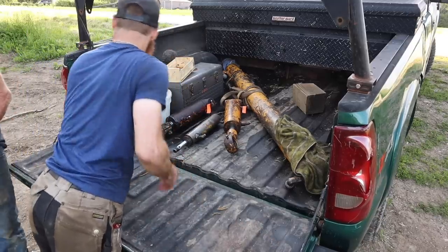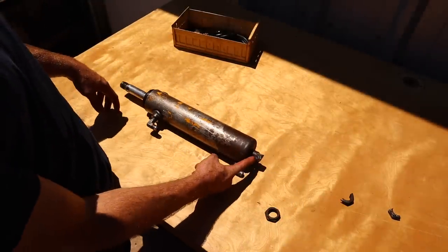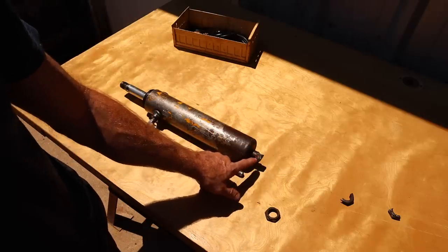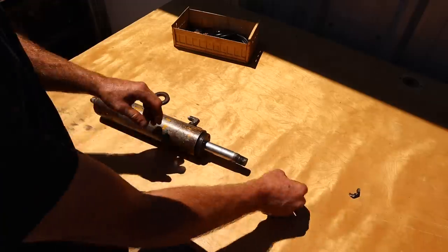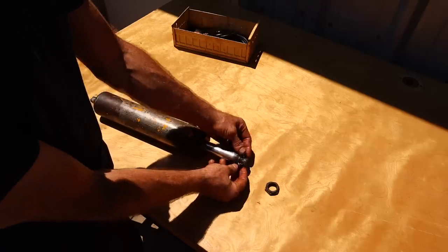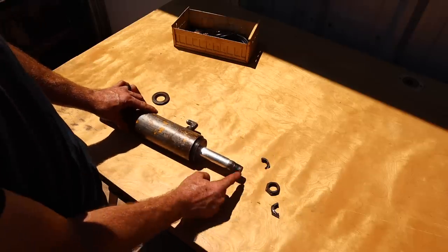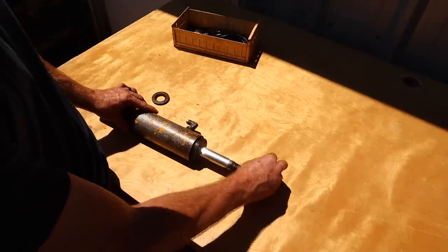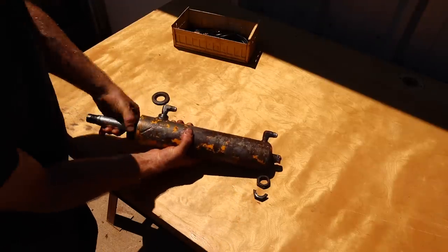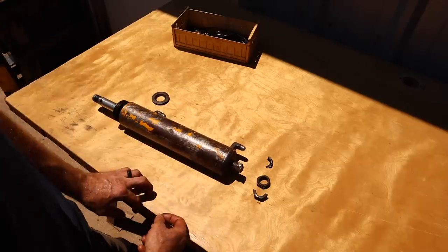Sit down, take a break. Yeah, I agree. So this is the side shift cylinder that allows the forks to go side to side. On this end, it had just a bunch of welds, little weld beads, just kind of holding it on, because the nut that should have gone on there probably was stripped out years ago, and that's just how they fixed it. The other end, they had this nut on first and then this one after it. I was able to get the first one off. The second one, I ended up having to take a die grinder and zip it off. I'm going to put a die over this, try and clean these threads up, reuse it, get a better nut than this one, and that'll be how I secure that side. This side, I haven't finished closing this up, so I can pull the cylinder out. I'll pull all that out, zip this off, weld a bolt to it, and it'll be good to go.